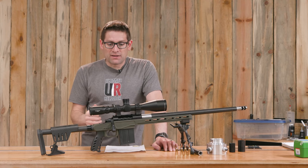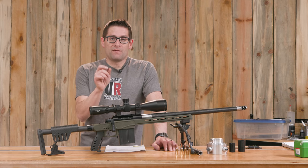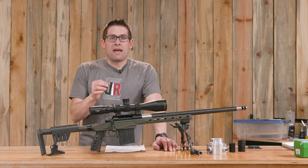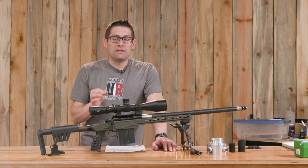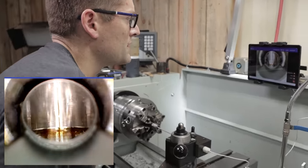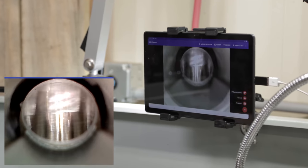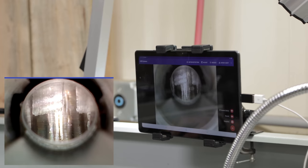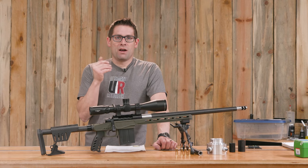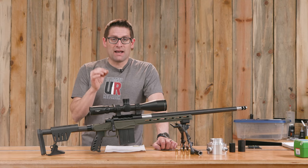I very carefully worked my way up, double checked, and the chambering was complete. I broke the edge to the entrance with a chamfer — about 15 to 20 thousandths on each side at a 45-degree angle — and used some sandpaper to scuff the inside of the chamber. Now using my tablet and my Teslong NTG100P borescope, I've got a great setup inspired by Gordy Gritter's — a quick change tool holder with the NTG100P mounted. I ran it right to that throat transition and things were running perfectly true. The Alpha Munitions reamer left very crisp, very clean-cut throat transition edges, which gives me an indication of how well this reamer is cutting.